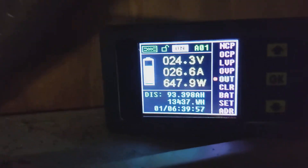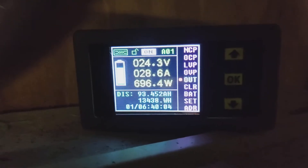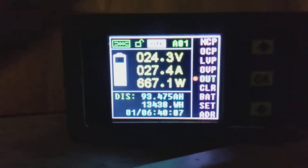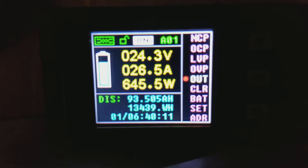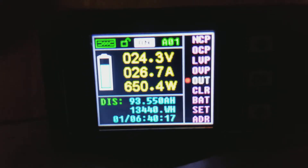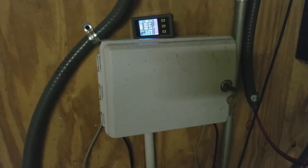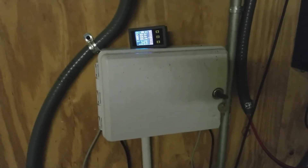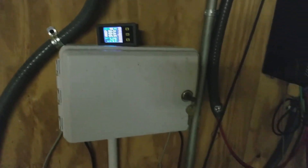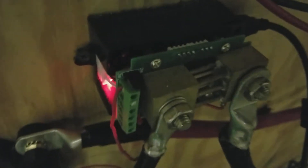Here's my little secondary system. I stuck this KK Moon wireless meter with shunt in place, and it does a really good job of tracking discharging and charging — amp hours, kilowatt hours, and such. It's like a coulomb meter basically. You can see state of charge based on historical information: how much battery power was taken out throughout the night versus the next day when it's charging, it reverses those numbers, so when it zeroes out you're back at the state of charge you started with.